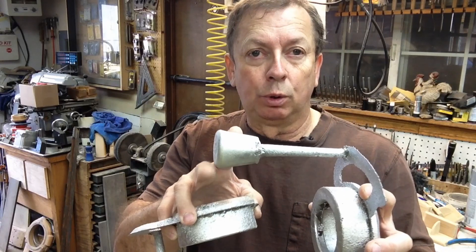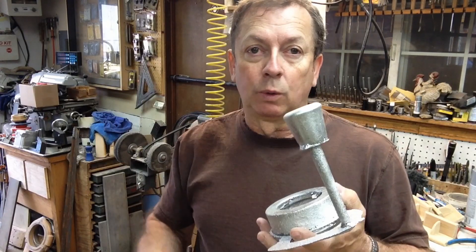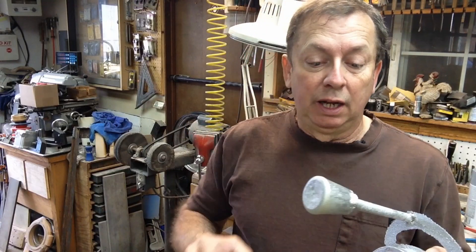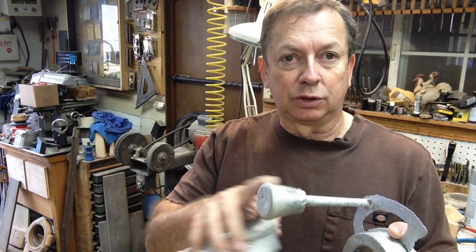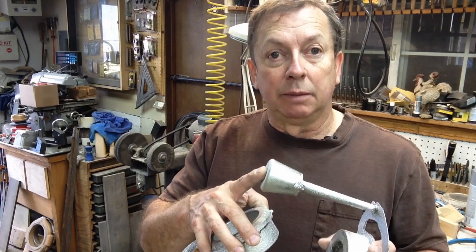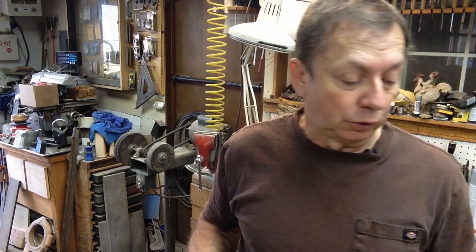This little piece on top is the pouring basin that I made the mold for - that works really well, I'm really happy with that. I'm going to make another one for risers, more of a straight riser to contain that metal shell when it's filled. We don't need a pouring basin in it, which will also help me differentiate when we put risers in.